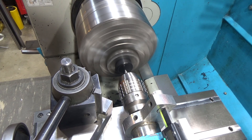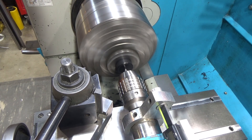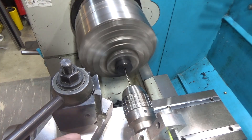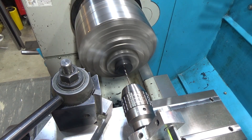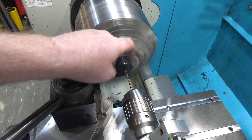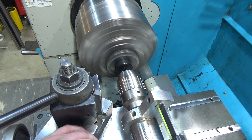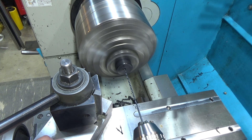This side can be made larger because I want it to lead the needles in, so I'm going to leave a tapered entrance like so, which is much bigger than the needles. Now I'll start to drill, making sure not to load up any chips because I don't want it to deflect the drill bit as it's going in. This is going to be a long and tedious process — I'm just sliding the whole tailstock in and out, making a small motion forward, then removing the swarf.